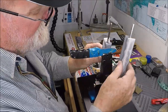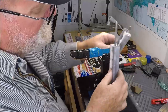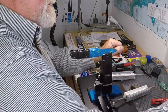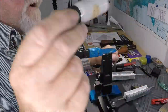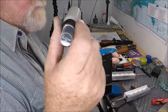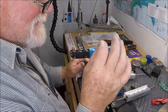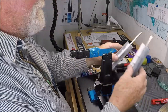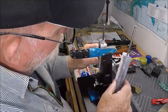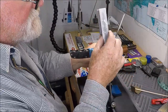So this was basically a reprofile. If you want to be able to read newspaper in your blade, I can take you there. I've got some two micron diamond spray — see how it's mixing up? I put this on the leather strops and I combine it with the 3M lapping films that have just the slightest little bit of grit to it, and it just polishes it up like a mirror. This is about done right now. Boy, is that edge looking good. I don't want to take off any more steel — I'm trying to polish out some of the scratch marks.